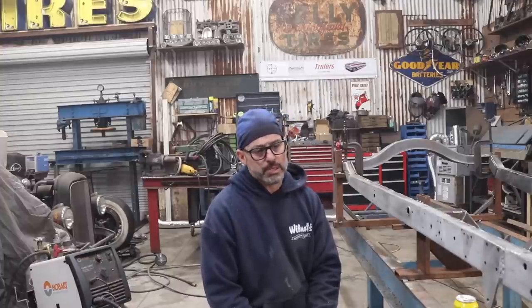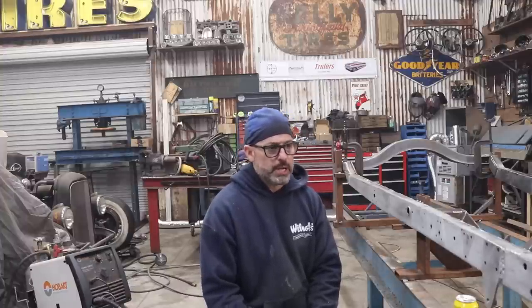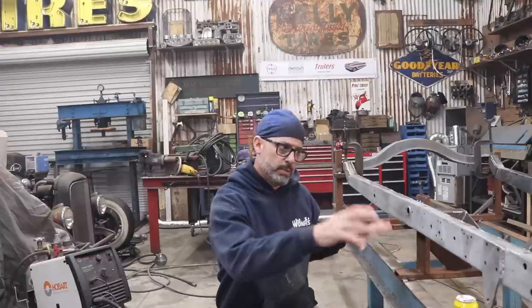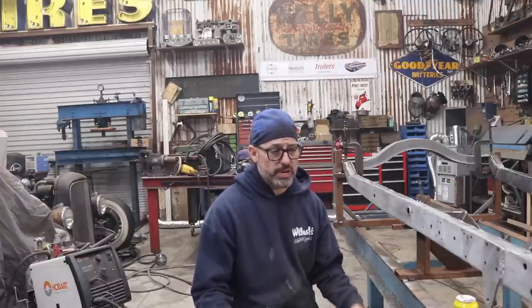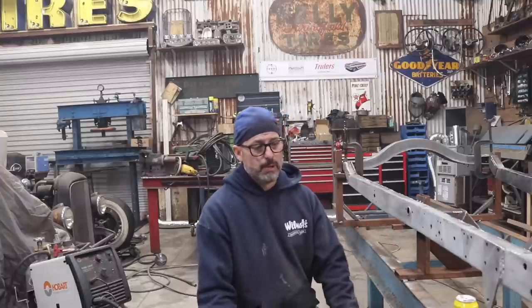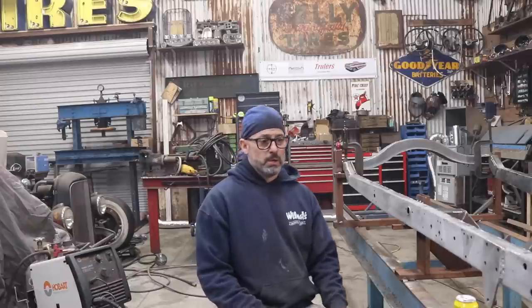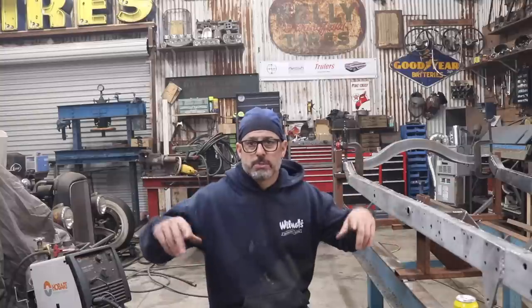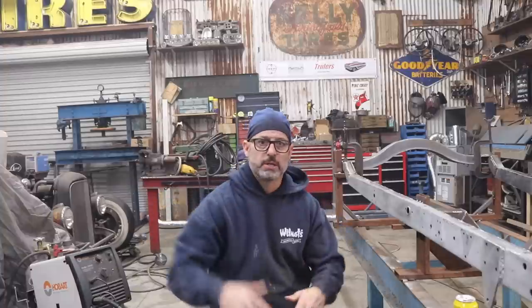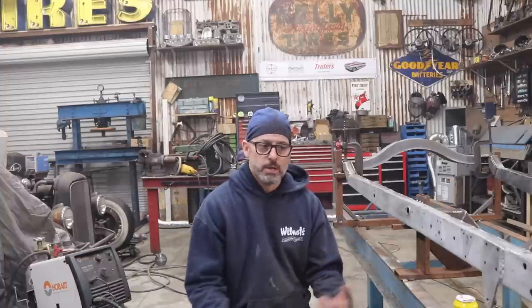Pretty straightforward process once you get the chassis mounted to the table, and once you get your stanchions or your stands built. You're essentially creating something to clamp the frame to. A lot of the work was building the stanchions, and even then it's just simple cuts, simple measurements. Something horizontal, something vertical, and then something to clamp the frame to, let the frame sit on it and make sure it's level. So as long as you're level, you get it clamped and you just start welding.